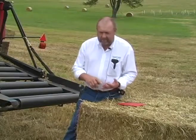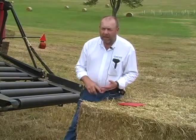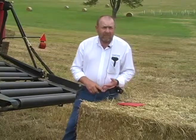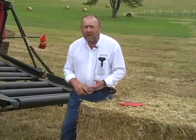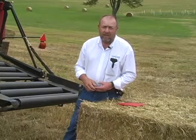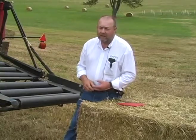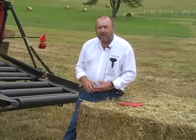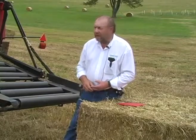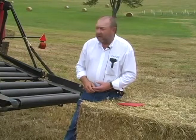We've got people that bale wheat straw and can get added weight in the bale. We've got people that bale a lot of corn stalks in the Midwest, probably here in the Northeast also. We've actually had people split out the corners on these big square balers because of build-up — they put these liners in and it solves the problem. I had one gentleman tell me he had split the corners on his large square baler, he ordered one of our liners, put it in, and baled 1,500 bales without stopping. That's pretty impressive.